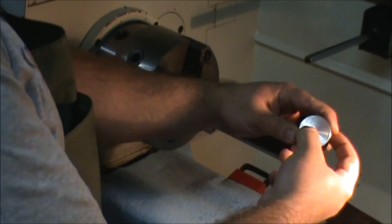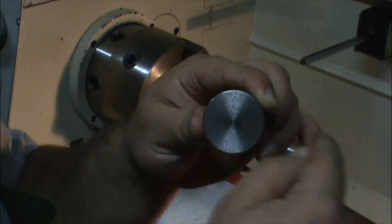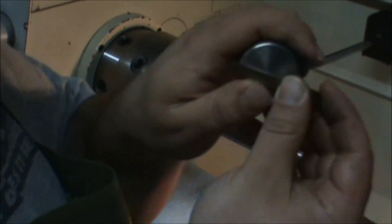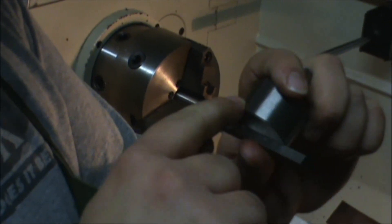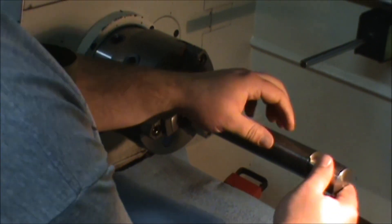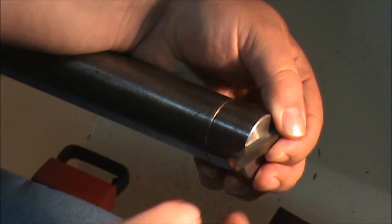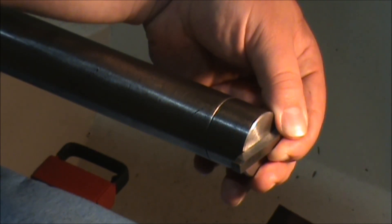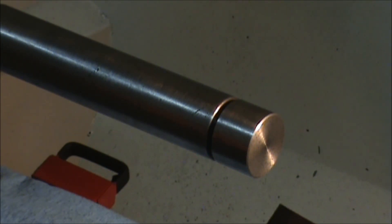In this piece right here, I'll go on the center line on the mill and I'll cut a quarter-inch wide slot to lay my high-speed steel in. It'll set inside of there, and then I'll come in the top, probably cut a flat, and put as many of those set screws in there as I can to come down and engage the bit. Then I'll have to cut this high-speed steel bit so that it'll fit inside my bore. When I mount it on here it'll be like so, except sunk in. I'll probably tackle that tomorrow - there'll be some mill work coming up. Thanks for watching.